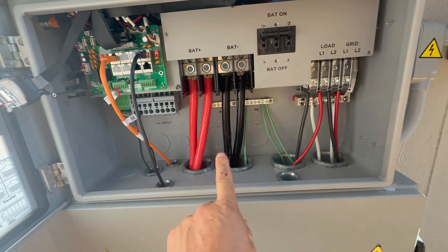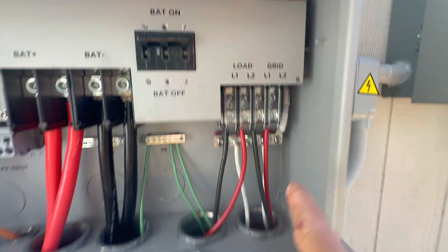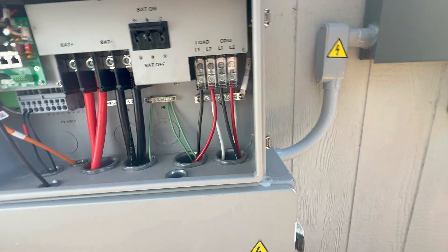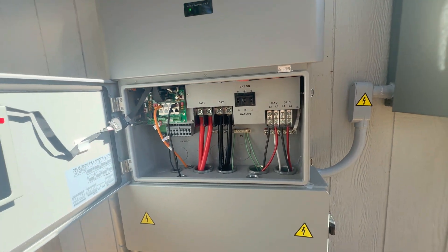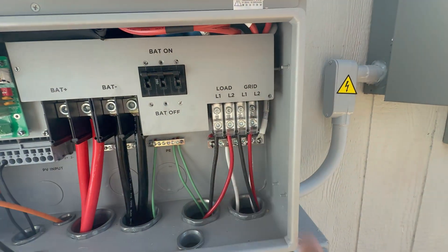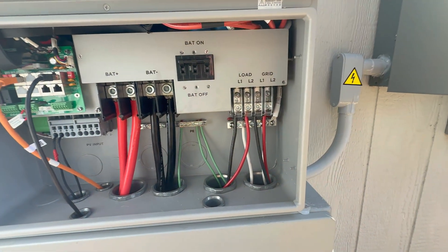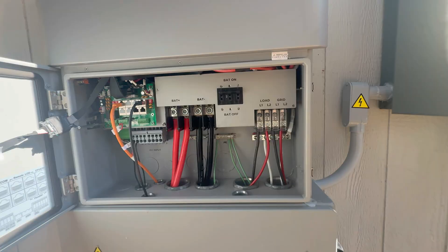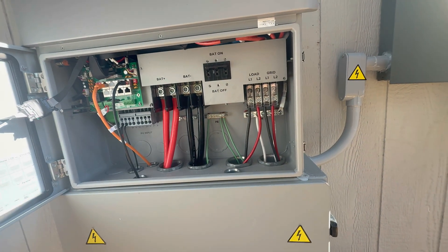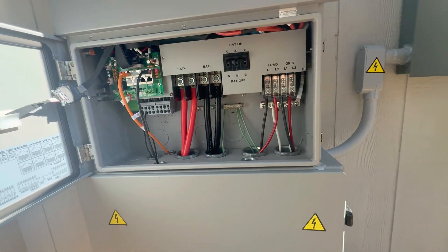You've got the battery here with two positive and two negative battery cables that get hooked right into those lugs back there, and you hook the grounds up back there. You're probably wondering what these other lines over here are — these are basically my grid connection, so that's my backup power. I'm going to be priority running on solar and battery power, but if there's a couple-day storm and I don't have enough battery, it'll go to grid. That connects about 300 feet away. I'll have links for all components and a discount code in the description.